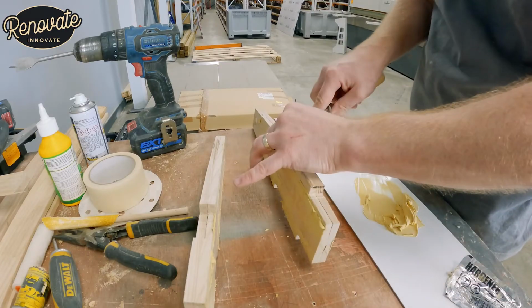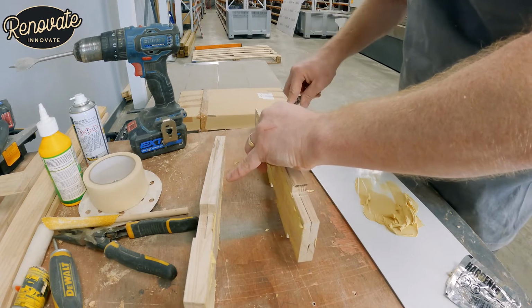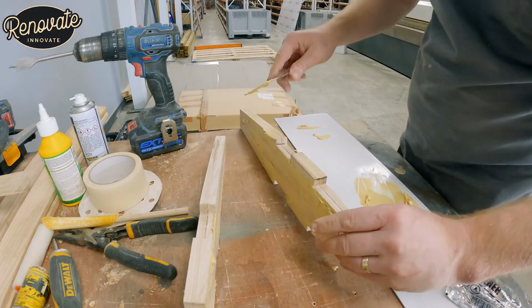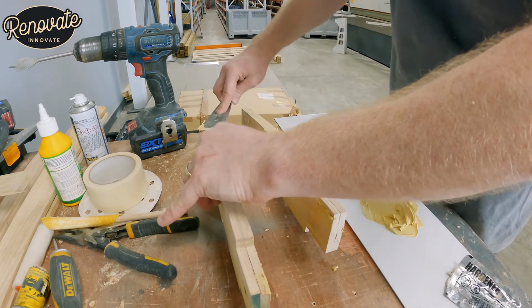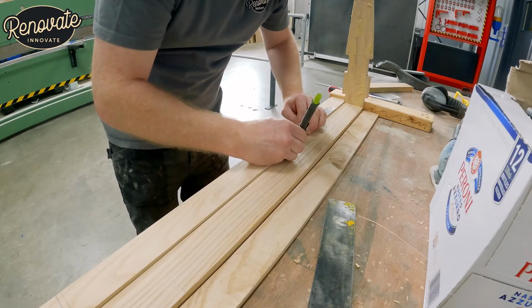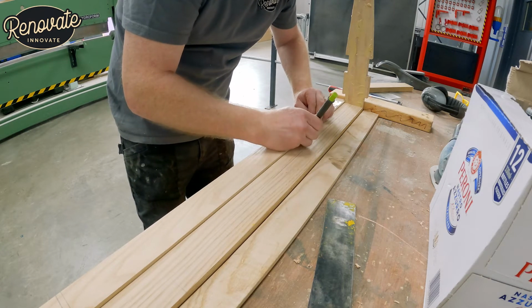All the pieces sanded. Got the holes drilled now as well, ready for the handle across the top. We just placed the two sides together, marked out, and just drilled them both at the same time, so we knew that it'd be nice and level when we put it in. Yeah, we've used here a coloured filler. It was close to the colour of the ash, but not perfect, but we thought it was good enough to use. And then we had another change of design.